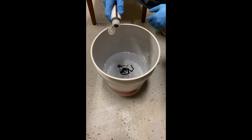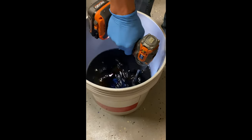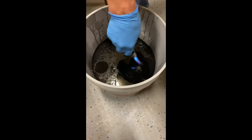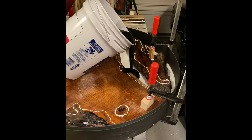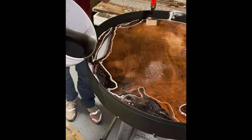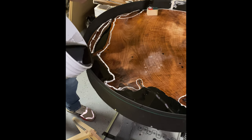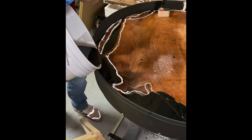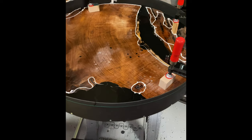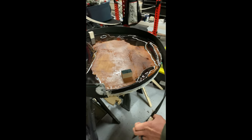I'm mixing some epoxy. One thing to note: when you mix epoxy, make sure you're mixing it for five to ten minutes with a drill. One time I did it for two or three minutes and it never set up. The form is doing a good job — not getting any leaks. I like to seal the top with either shellac or clear epoxy just to prevent staining the wood, then I flood it and let it dry for about a week.